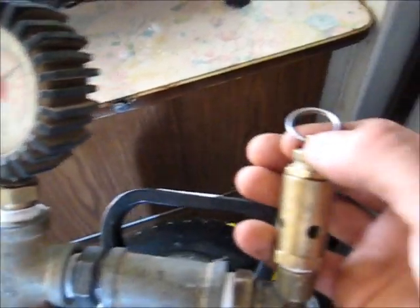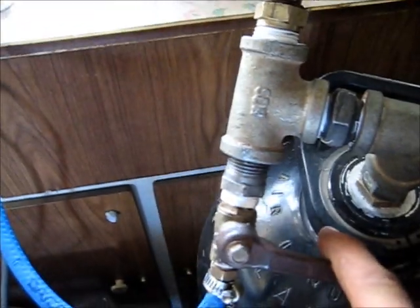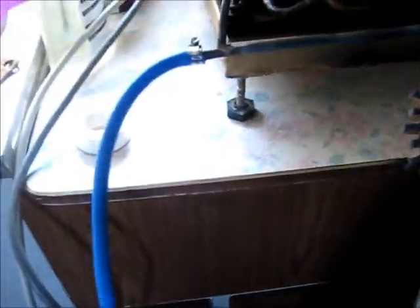That's calibrated there. A tiny bit tighter and that will just seal it and hold it slightly above 120 — about 123 — to allow for leakage. There you go, so that will pop at about 125 psi, and as it hits 120 it'll be a complete seal, keeping the tank at that pressure but won't put anything over that. That's my little bit of safety margin. I'll tighten this nut up. There's no leaks — I'll give this a check for leaks. No leaks, it's good. Get a little shifter here and tighten this nut up.